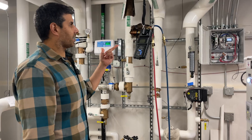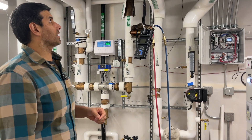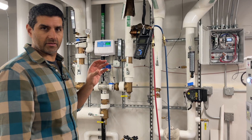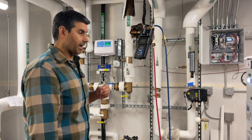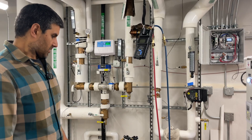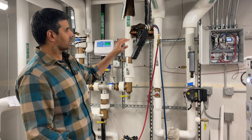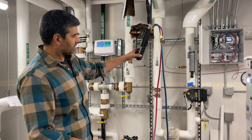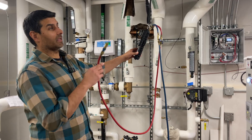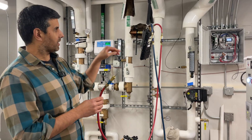What we have here is the TSI hydronic manometer from the Smart Buildings Center. We're going to use it today to measure the flow — or the pressure differential — across a circuit setter balancing valve to determine the flow, and use the manometer to set the flow as we want it to be. We have the manometer hanging from the pipe so we can read the readout, and it has attached lines that get installed in the ports on the balancing valve. These are just needles with small holes to measure the pressure.